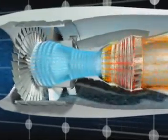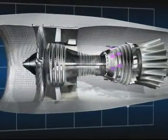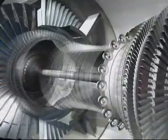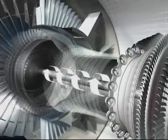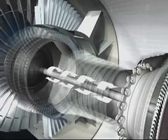Finally, the accumulated energy is extracted in the five turbine stages immediately after the combustion section. The pressure of the air drops as it passes through the turbines and makes them spin, and the turbines, whose shafts ride within one another concentrically, in turn drive the fan and the two compressors. The air is then expelled through the primary duct, joining the air from the fan stream.